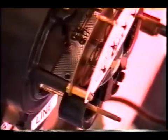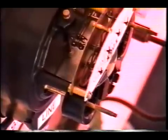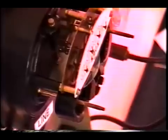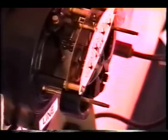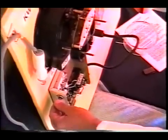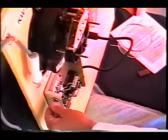Turn it back off and it resumes normal speed. Turn it back on and it stops it. Now I'll do a potentiometer adjustment to show you how that affects it. When it's not in resonance, it almost resumes full speed. But when I turn the potentiometer until it hits resonance, you will see it slows and stops it. You also notice a kind of a chattering sound — that's what happens to the rotating disk when it's near the resonant point that stops it. It chatters.